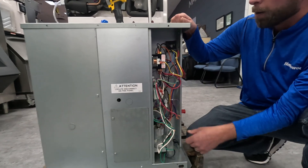At this point, this red wire on terminal 3 needs to be removed from the timer and put next to the other red wire on the L2 side of the contactor.